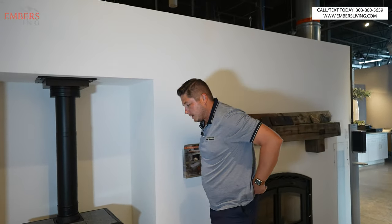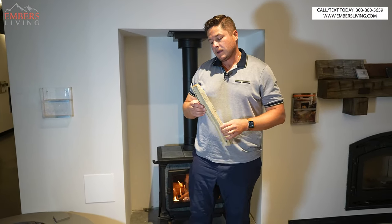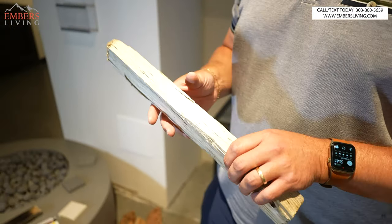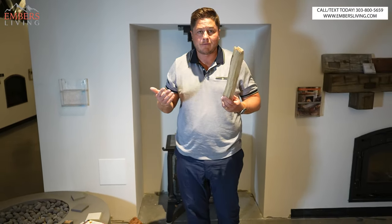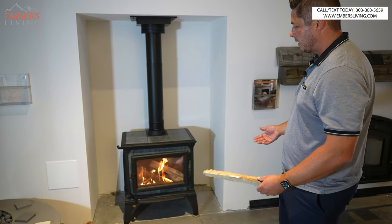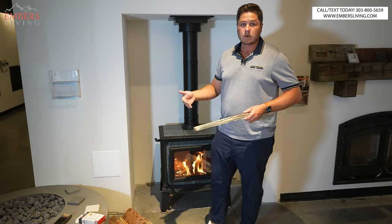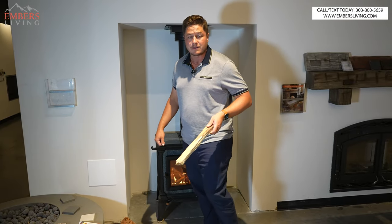Another variable is going to be type of wood you're using. Here in Colorado we just have a lot of pine — it's everywhere. Pine is a softwood, so ideally you want to be burning hardwoods; they're going to burn longer, burn cleaner, and not gunk up the stove as bad. Colorado is really hard to get around because there are piles and piles of pine wood all over the state, and a lot of times people are giving it away as a free fuel source. Pine is a softwood so it catches fire a lot easier — maybe use pine as kindling, then transition to good solid hardwood. Hardwoods are a little more temperamental but they burn hotter once they get going.